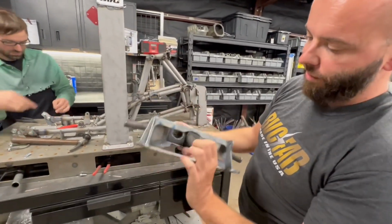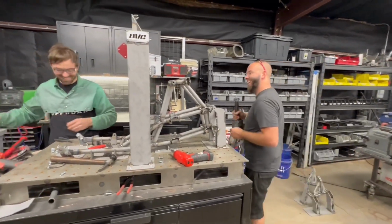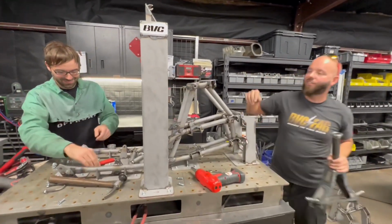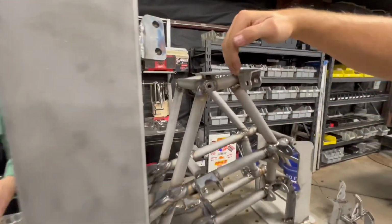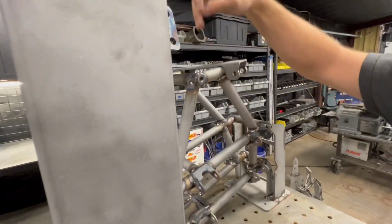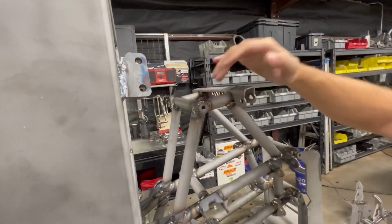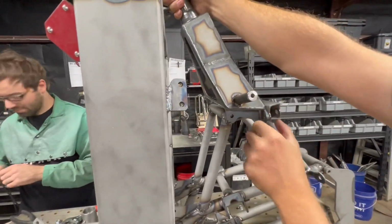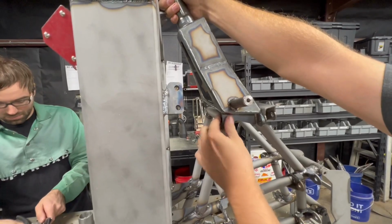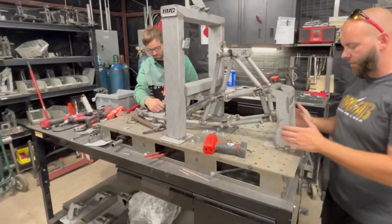It's not overbuilt. It's actually not as heavy as I thought it would be, Drew, honestly, with all the weld and stuff. You can see how we got these tied in right here. Normally on a quad frame, the tube's just going to go straight up and kind of back. We have a piece going across, so everything's tied together. We got the dual support on this tower, doubling up here, and it's sending all that load right up to the top. Man, I'm excited.